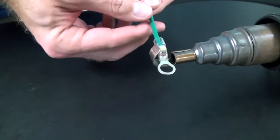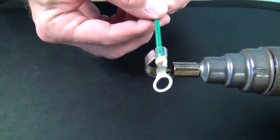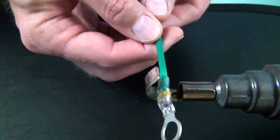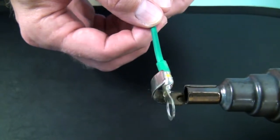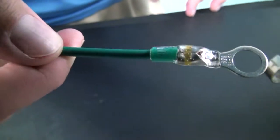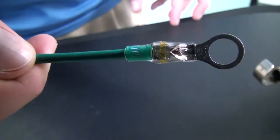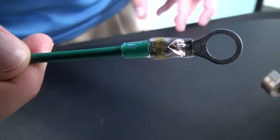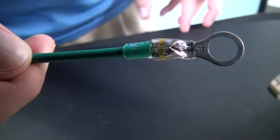When recovering the tubing, start by focusing the heat at the middle of the connector. Heat the unrecovered tubing towards your wire's insulation. You'll want to make sure any air under the tubing is forced out as the tubing recovers. The crystal clear tubing and the terminal's 45-degree window allow for visual inspection of your wire's copper strands over the life of the terminal.